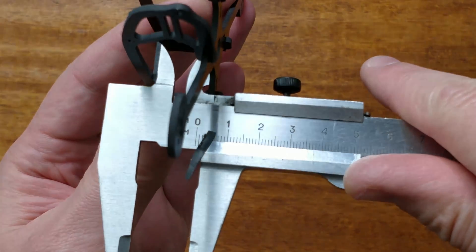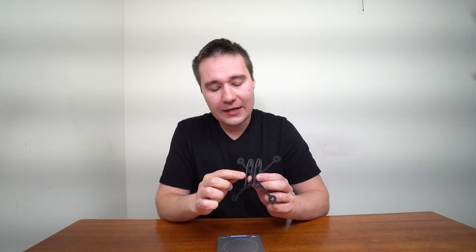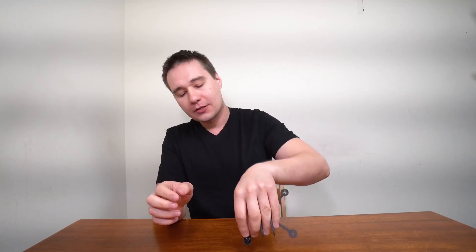The X layout also allows for much more stable flight characteristics. The frame is 2mm thick, and the space in the cage is up to 18mm. Let's put it on the scales — the weight of the frame is 10g 46mg, approximately the same weight as the Ascent 2 inch. Further weight savings would only be possible by reducing cage thickness, which I didn't want to do since a hard crash could break it and damage your electronics. Another feature is the extra large borders for the motors, meaning the motor is fairly well protected in a crash.